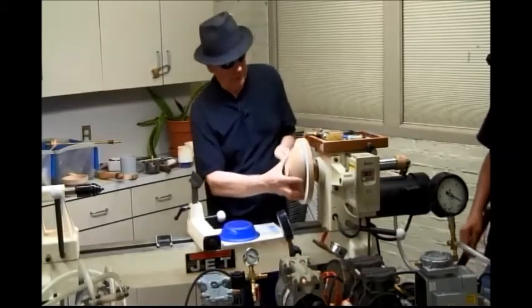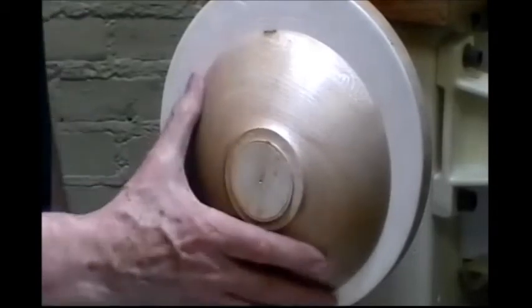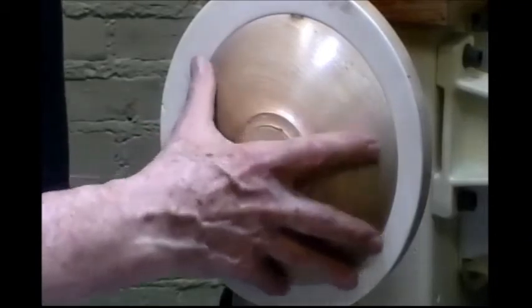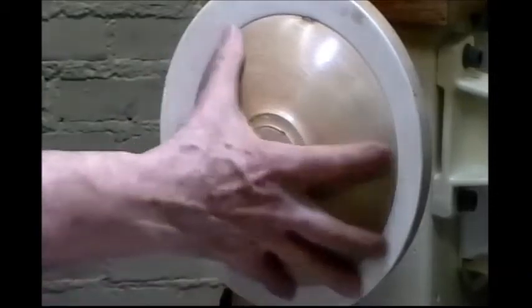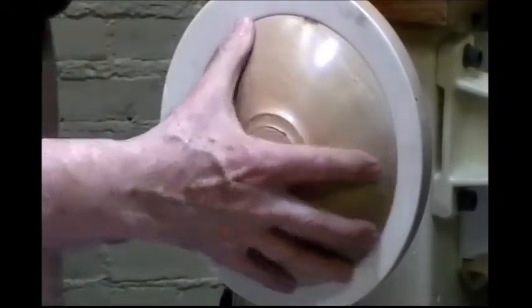Now here's another bowl that's a lot thinner, but it's got a sanding sealer put on it first, so we'll put that on. Ready. How far up you want to go? There's 10. That's 10? Uh-huh. Yeah. 11. And see, this is about an 8-inch bowl, so I got 250 pounds holding this on right now. I don't want to put any more of it on. It's a pretty thin bowl.